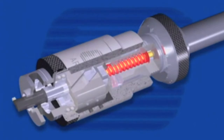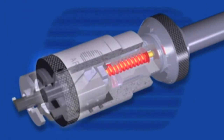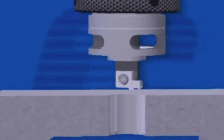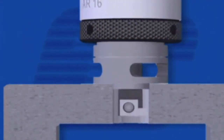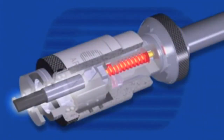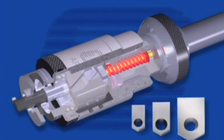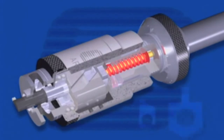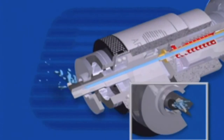The spring separates the front and rear body sections during the return stroke in order to retract the cutter. The pilot is mounted on the front body in a bearing that allows it to stop rotating when it comes in contact with the workpiece, maintaining the tool's position without marring the workpiece. The cutter consists of tool holder and insert. Replaceable carbide inserts made from standard insert blanks are available for most applications, and special or intricate insert forms are available for cutting a variety of profiles.